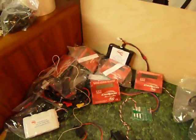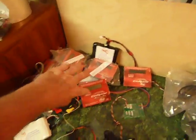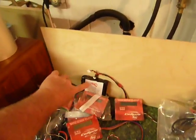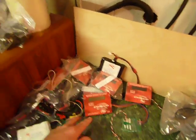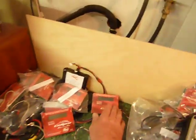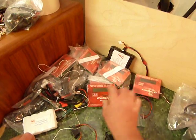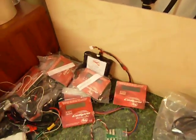Okay, so we've got two chargers running on two 12-volt batteries. This one is hooked to this 12-volt — actually 13.2-volt A123. And this one is hooked to the 13.2-volt LiFE. I have drained 100 milliamps out of each one of these batteries previously — didn't want it to be a long test. You can see we're up to 95% here and 92. We got 44 milliamps gone into that one, 35 into that one — a little bit behind.